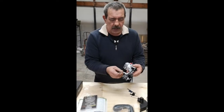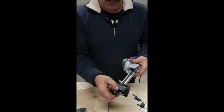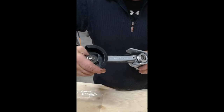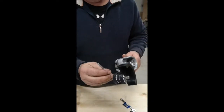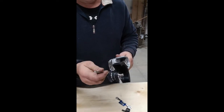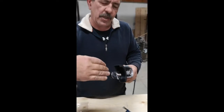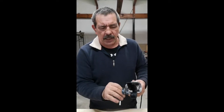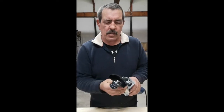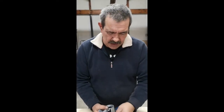Because this is spring-loaded, you just loosen this off and let it pop — you see it came out there. I can push it in and out; it puts the tension on the belt. This shaft inside has a flat on it so it aligns properly, and even if it was turned a tiny bit, it's not going to hurt anything because there's enough length on the belt to accommodate for that.